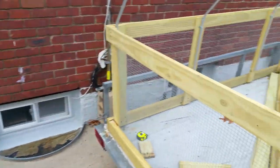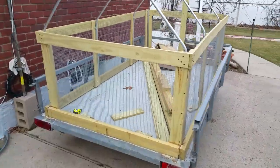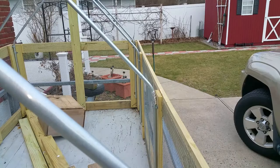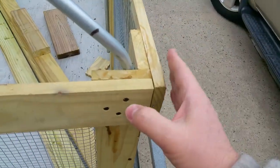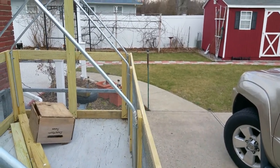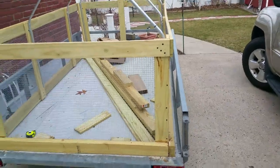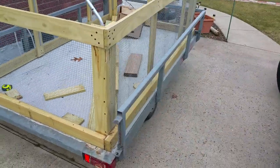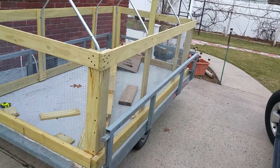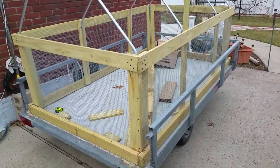Here's the beauty of it: I can raise these beams or bars back up, and if I do that, I then wind up with this elbow here coming up to a height of almost exactly four feet from the bottom of the runner. So that four-foot side makes me say, nice building size — I get a four-foot piece of plywood to go along the side and I've got a hardened wall pretty quick and easy. I was happy about that and it was sort of just a coincidence.